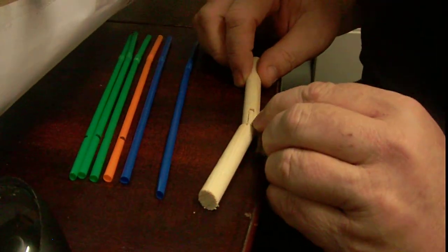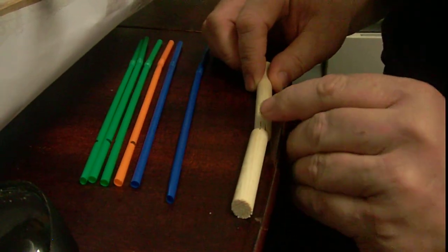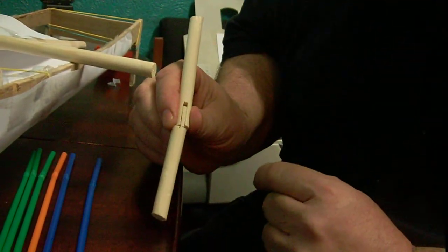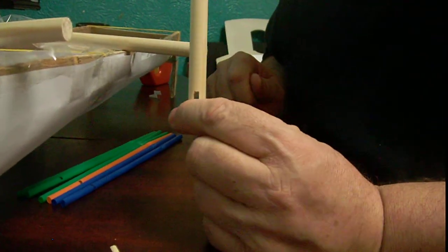The piece in the middle doesn't give you any strength. The strength is this side and that side. And those are the two pieces that are cut. That's why it breaks. It's not the thickness of the wood. It's how much you've lost on both sides. So hang on. If we make that same thickness as both of those sides, it'll make that stronger. Or will it still break? If you drill a hole right the way through the middle there, almost half the size of the wood, and then try and bend it, it will eventually break on that spot, but it won't make it much weaker.